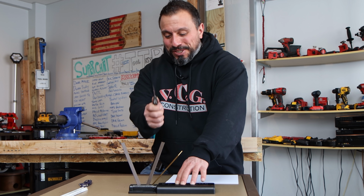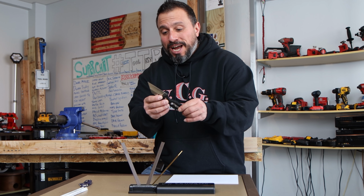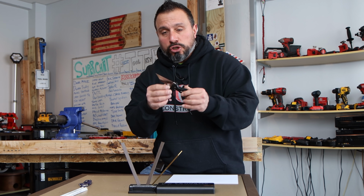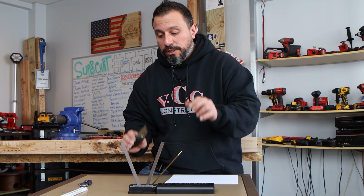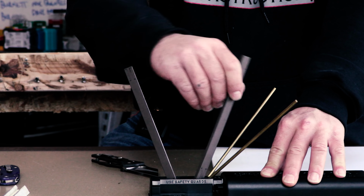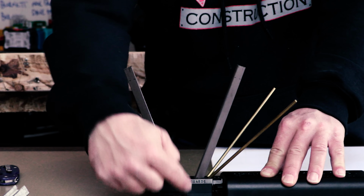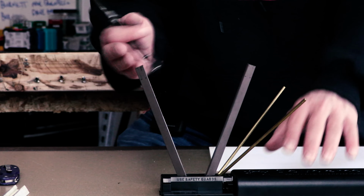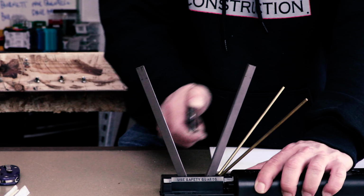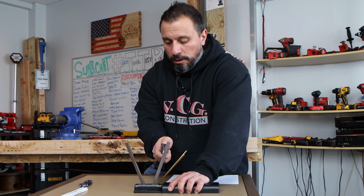We made enough strokes down these brown stones with the points pointed to one another enough times to get our chip out of our blade. So we have a great starting point to sharpen this knife. The next step, we're going to turn these stones so that the flat sides face one another at the 40-degree angle. At this point now, we can just continue, but we only have to go down the stones 20 times per side.